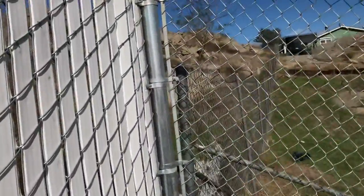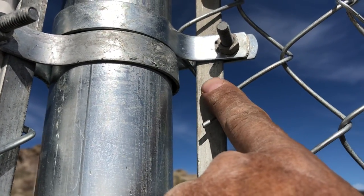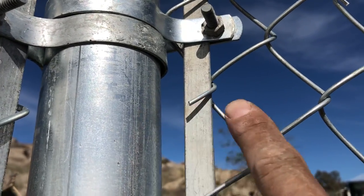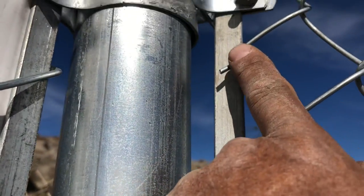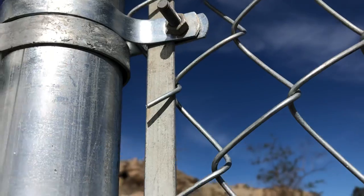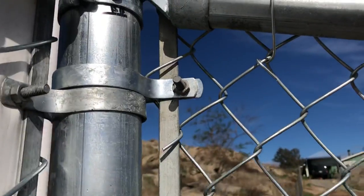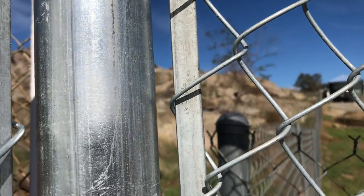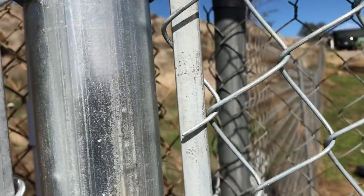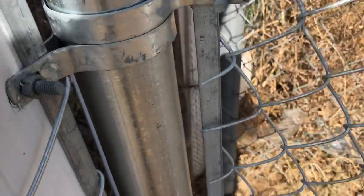And basically, if you haven't seen the other video, you can take the bar and put this bar behind this tail, and that will scoot each one over a little bit more. You can also bend these over in the end and knuckle them, but we're putting slats in here, so when the slats come down, they go as far as they can without being scrunched over. But that is a cut one, skip one, and so on all the way down. So it is a really consistent cut.